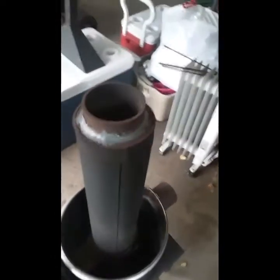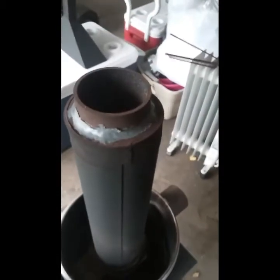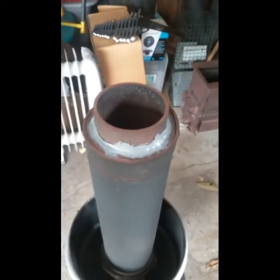Here's my riser tube and how I installed it — I actually cut out a piece of six-inch inside-diameter pipe, then cut out a square piece to put on top where the riser tube rises. I welded these two on, slid the six-inch pipe into the six-inch inside-diameter pipe. I did insulate this with perlite, and on the top I got a six-inch cap, cut the hole to the diameter of my riser tube, then filled it with perlite and packed it down.